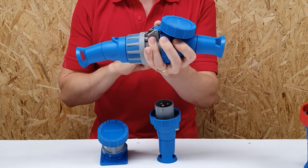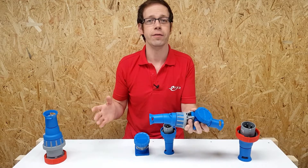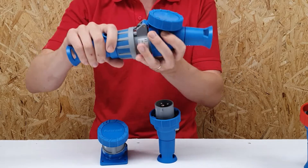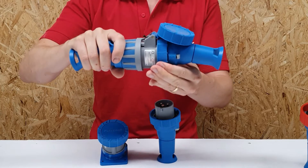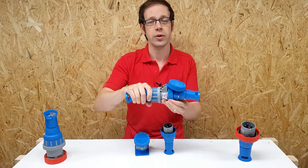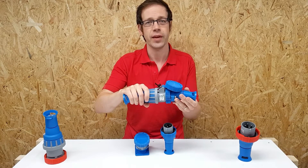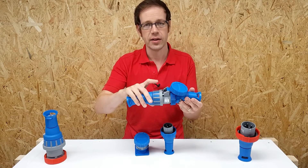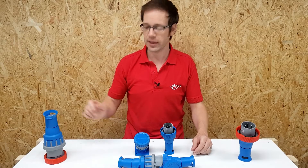This range of industrial connectors clearly has the capacity to create a safer workplace. All you have to do is make the connection, tighten up the connecting ring on the plug, then energize — and we won't see the disastrous effects from the earlier footage should we be connecting a faulty load. But what else makes this switch special? It's what's called an AC23 switch.